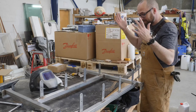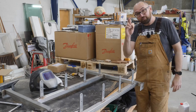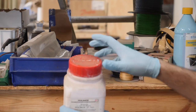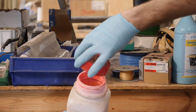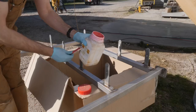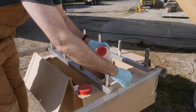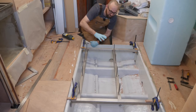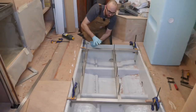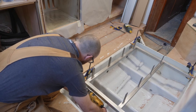And here we go — the frame is now 99.9% done. The very last thing I need to do is just passivate the welds so they hopefully don't start rusting. An alternative would be to get the entire frame dipped like I did with the rudder stock, but for the frame this delicious looking liquid should do the trick. This is something that's most definitely going to take place outdoors. I'll leave it for 15 minutes and then we'll see what it looks like. It only took about 15 minutes for the welds to beautify. After the acid was done doing its magic I rinsed the frame with some water, left it outside to dry, and the next step is to drill the holes to through-bolt the frame to the structural members.